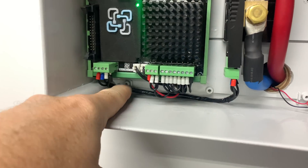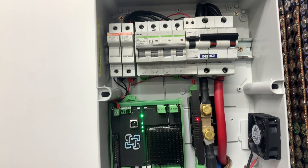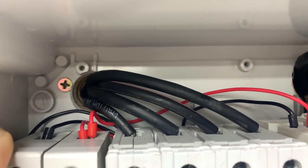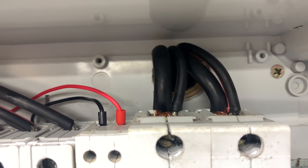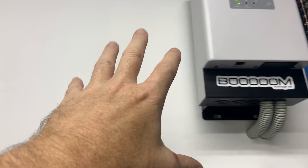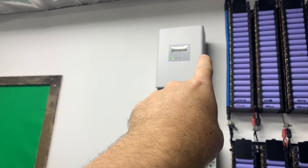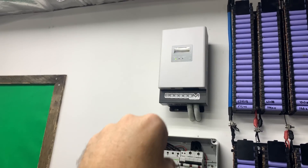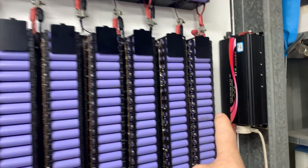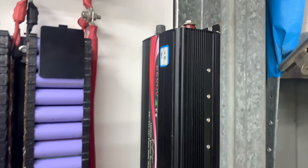This has just got some tape on it and I don't like the way that looks either — I wouldn't mind cleaning that up. I know that's a little bit pedantic, but I am enjoying this process of designing and redesigning this over and over again until it looks perfect. I've got all those cables there from the solar back up to the charge controller, all neat and tidy. We've got the four cables there — two from the solar charge controller in, and then two that go out to the inverter. For the inverter, I was actually going to put that up here, but I'm going to reserve that area because I yet might buy a PIP 3024 — a 3,000 watt inverter — and replace that PCM60X. I don't know how I'm going to justify that at the moment, because then I'm going to get an electrician in. But at the moment I've just run this little 1,000 watt pure chinesium inverter that one of the community members loaned me. I've just got a couple of bits of board and used them to sandwich it in. All behind there is open, which allows for good airflow.